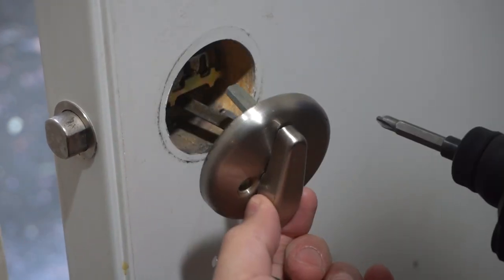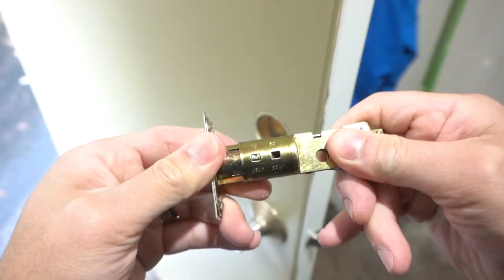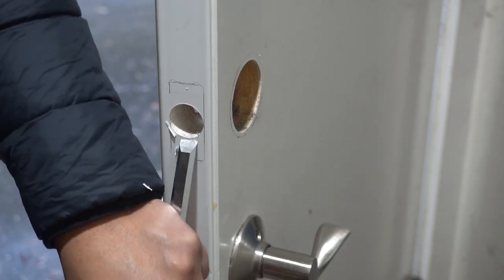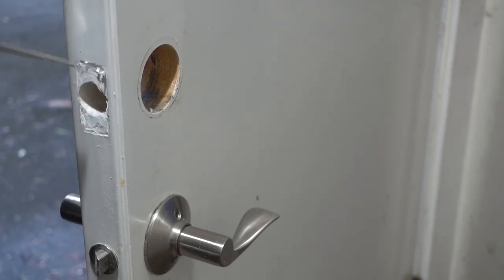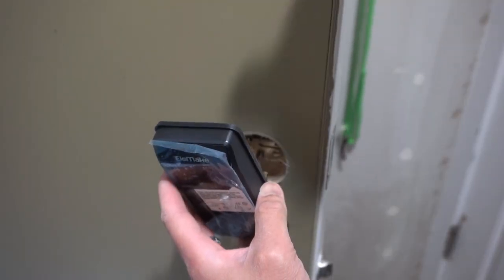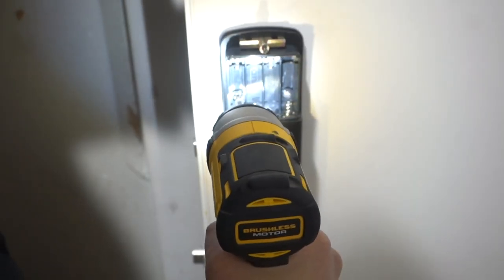Now this one is a deadbolt version by Elemake. This one is a little more complicated because it has a lot more parts and is bulkier, but it's designed for your deadbolt. Just like the past two door locks, this has a keypad feature, a fingerprint option, and also a key for backup. You can adjust the door latch length just like the other two locks, and again we have to chisel out for the door latch. This one was a little bit harder to chisel out because the door is made out of vinyl. It has a gasket sealing for the outside and the inside, which is great because it will protect it from the elements such as rain. The other two door knob locks were made specifically for inside use, but this one is made for the outside entry door and has a security plate — it also takes four AA batteries.